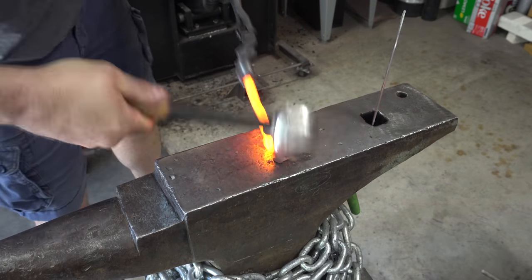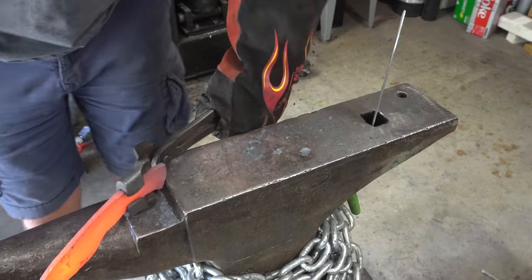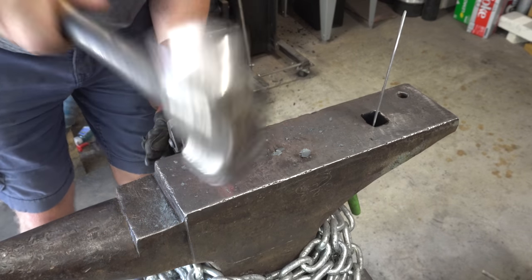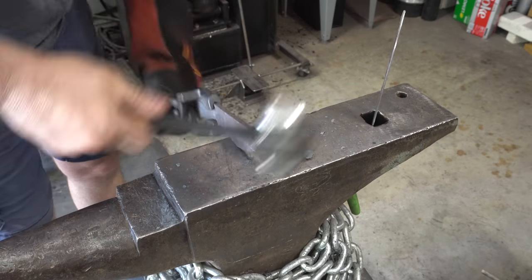When I'm working on the blade, I'm making sure I'm hitting down the corners of the front at a 45 just so I don't get the fish lips. That's where the front of your blade starts to fold down and you get this weird inside curve.